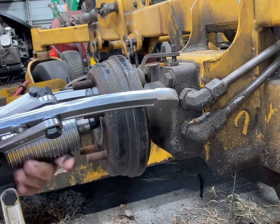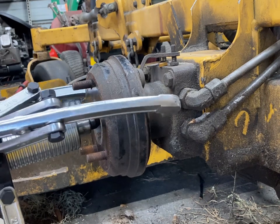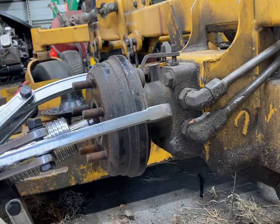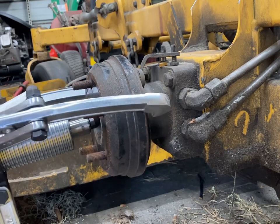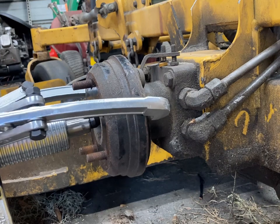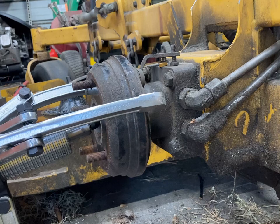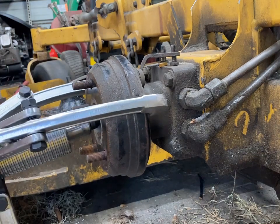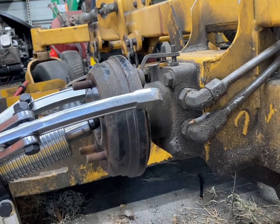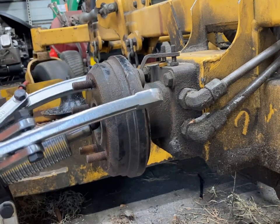Then use my hand, freehand, to bring up the lower jaw. On this puller, I wish they had another setting closer because I run nearly out of stroke on it before I get engagement to the drum rim. You don't want to get it on the backing plate — you want it on the rim.